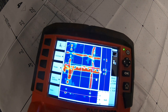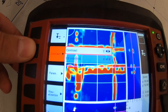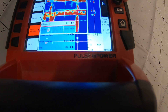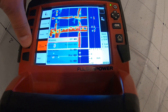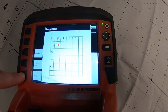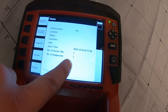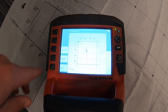On the left side you can change your contrast, change your parameters like your concrete dielectric value, go from method to advanced and standard, and go to your visualization to turn your EM sensor on or off — still no electromagnetic activity for me. That's how this image scan works. You can see it's now saved — I have my quick scan recording from my earlier video and now I have this image scan recording as well.